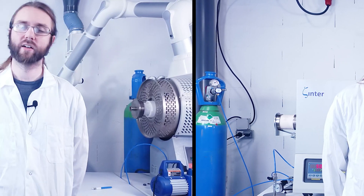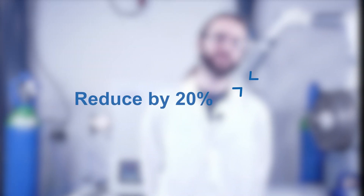In practice, sintering a part consists in heating it up between 1350°C and 1550°C. Depending on the material, the temperatures and ramps can change. Usually a 50°C per hour ramp is used and the maximum temperature is held for two hours when it is reached. Moreover, the sintering process triggers a shrinkage — the part size reduces by up to 20% because it densifies. Don't forget to scale up your part during file preparation in the slicer to make sure your final part has the right dimensions.